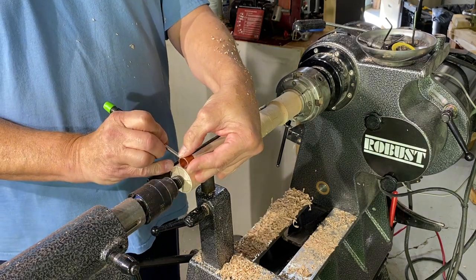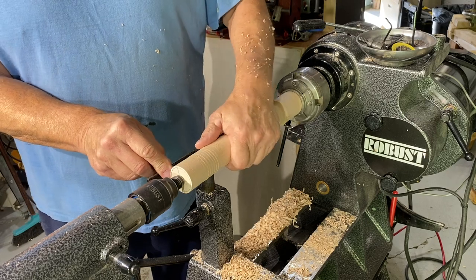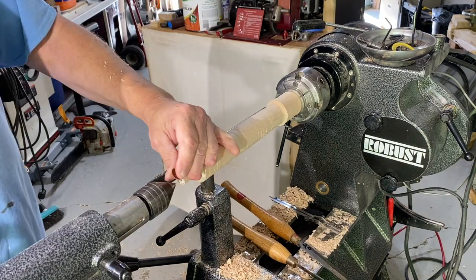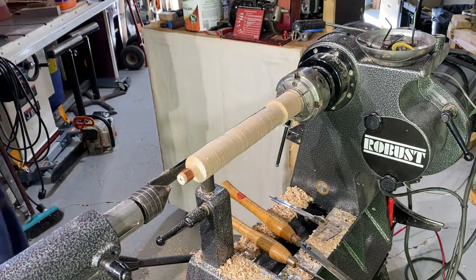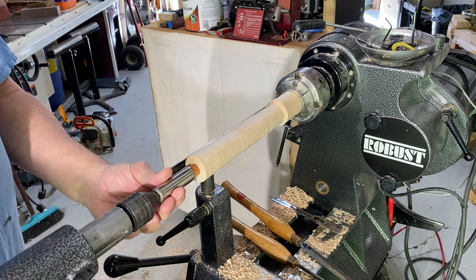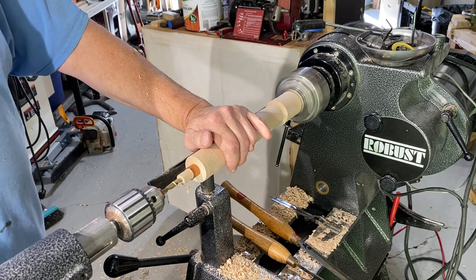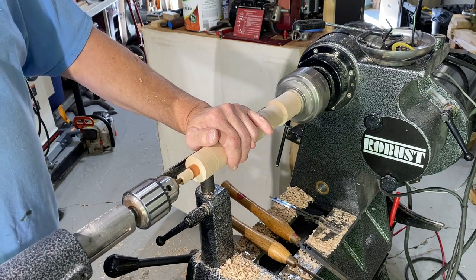What I'm going to do is get a mark on here so I know where I've got to go. Then I need to know how big this cylinder needs to be — well, that's easy enough to figure out. Take your calipers. Here I'm finishing up the smaller version of the handle. The reason why I'm even doing a small version of the handle is that I lost the video on the large ones, but it's the same process. Here I'm using a quarter inch drill bit to drill my hole for the quarter inch high speed steel bit that I'm putting into the smaller kit. The other one is a five eighths inch rod that I'm drilling in through, so it's just larger tools — same procedure. Just thought you'd like to see how I go about putting a handle together.